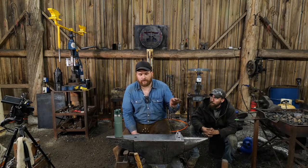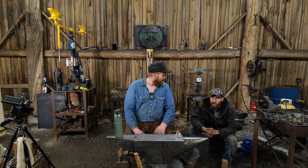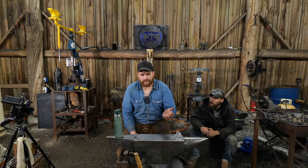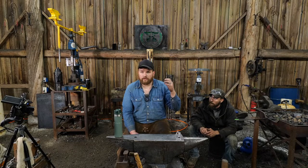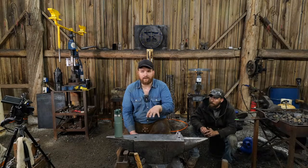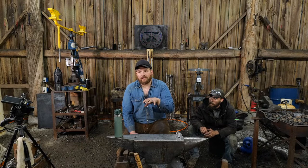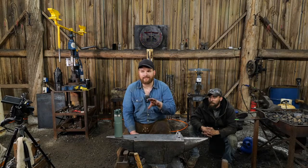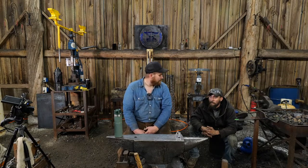So all Achio anvils are cast steel anvils, at least the ones that I have found, and I have bought a lot of them, more than I should over time. Even if they say forged steel, even if they say cast iron, they are a cast steel anvil. Your Harbor Freight 55-pound blue anvil, the Central Forge anvil, that is cast iron. Not ductile iron, not cast steel, it's cast iron, which makes it an inferior quality anvil compared to their other option, which is their Doyle brand anvil. If you're going to buy an anvil from Harbor Freight, I recommend the Doyle brand anvil. The Doyle brand anvil is a hardened cast steel anvil. If they change it up to where it's forged steel, they're lying. It's cast steel. So just beware on that.